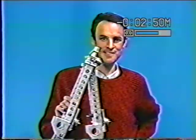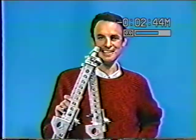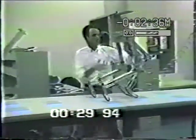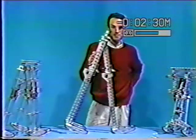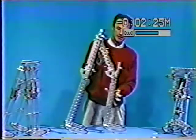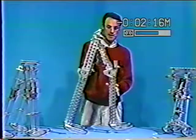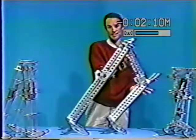We take video of every experiment we do, and the camera was running the day when the analysis and my intuition were brought conclusively into line. Those few steps convinced us that we had the dynamics right. The reason the machine failed was a problem called knee bounce — when the shank went to full extension towards the end of the stride, it didn't stay against the mechanical stop but instead bounced back. On the last step it was still in a flex position when the foot hit the ground, and the leg just buckled.